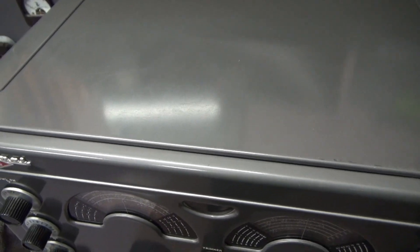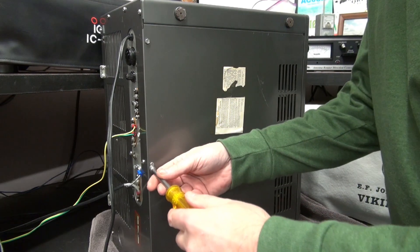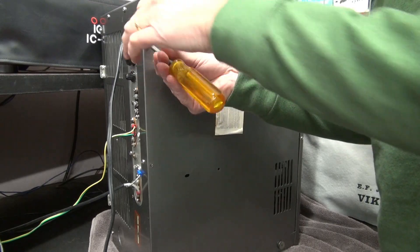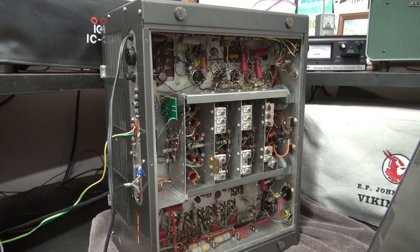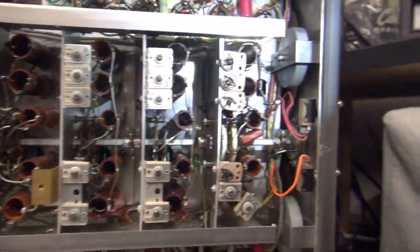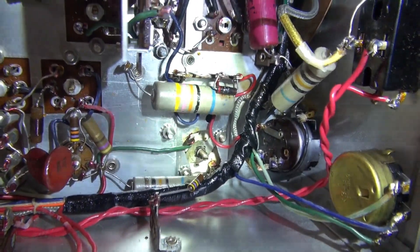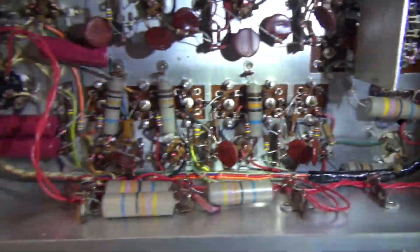We're going to pop the bottom and see what's going on — follow the smoke path. You're seeing this as I see it; it should be interesting. I'm guessing we're going to see a big wad of paper that flew out of a capacitor. Scanning the bottom, I don't see signs of an explosion yet. But now if you take a look down here, there is a fried resistor right there going to that big goofy-looking bumblebee cap. So maybe that cap is shorted, but that would not have produced the sound that I heard.